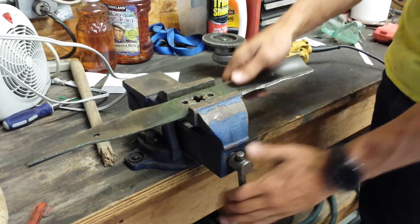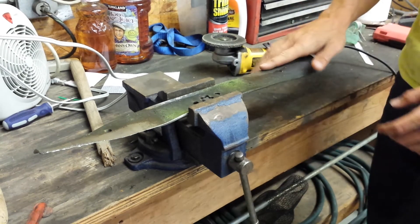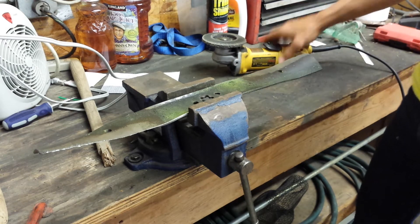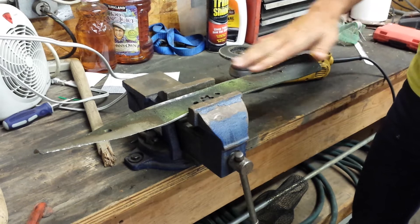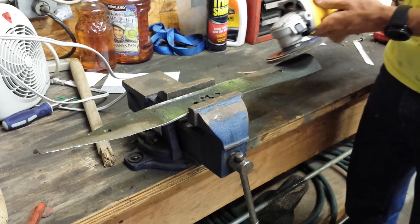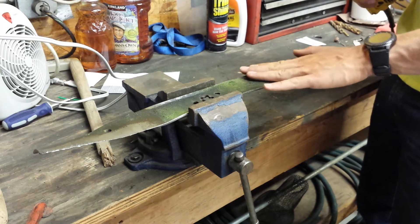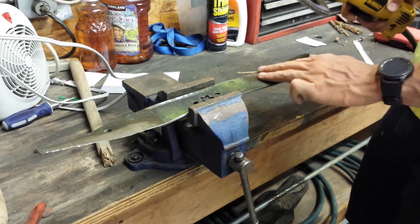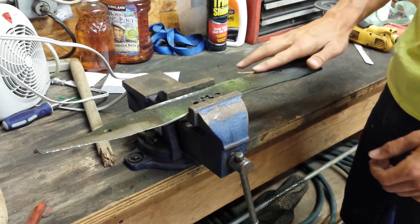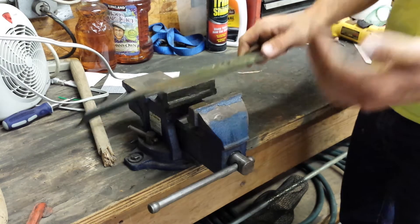So you're going to sharpen the first edge. What I always do after that is — even though you don't sharpen the rear edge — you're going to make sure there's no burr on it. If you run your finger across flat and feel a ridge, you want to take your grinder and just rub that off a little bit. You're not going to put the grinder at any angle — you're going to hold it completely flat, flush with the back of the blade, just to take that little burr off. That gives you the optimum cutting angle. So all I did was a quick sweep back and forth — I didn't sharpen the blade, I just took that little burr off.